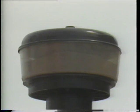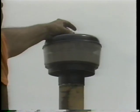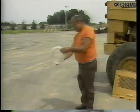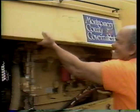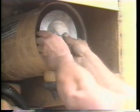Once you have finished with the engine's cooling system, you can check the engine's air filter system. Begin with an inspection of the pre-cleaner bowl. If dust or other material has accumulated in the bowl, clean it: dump out the dirt and wipe with a clean rag. Be careful if the pre-cleaner is plastic, as it can crack or break if hit against a hard surface. Daily cleaning of the pre-filter will greatly reduce clogging of the air filter elements. The indicator warns you when to clean or replace the dry type air cleaner element. Dry type elements should be replaced with a new element or a serviced element that has been vacuum cleaned and inspected by specialized shop equipment.